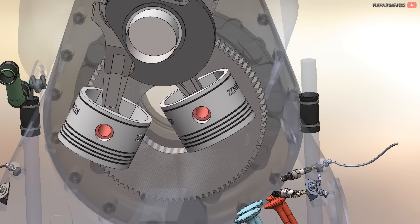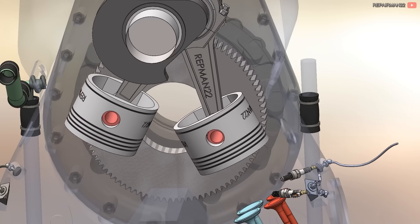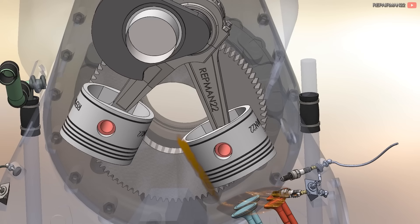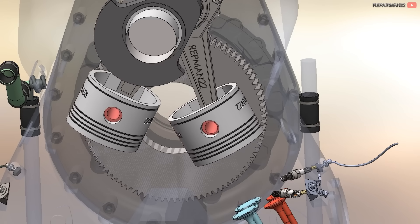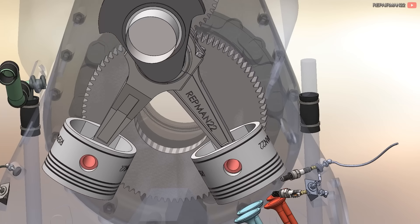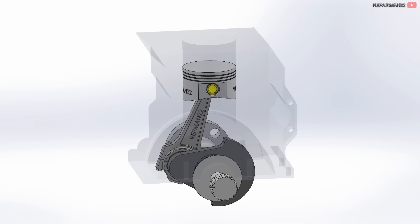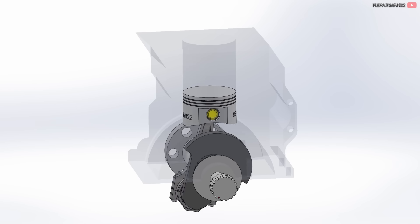This was the only way to prevent oil from passing through the rings into the combustion chamber and burning. If the engine was stopped for a long time, the cylinders could become flooded with oil and spark plugs had to be removed and cleaned. The lower ring also helped to center the piston in the cylinder. Otherwise, while being so long, it would produce a pitching effect, which makes noise and accelerates wear.